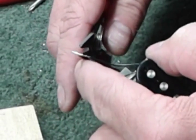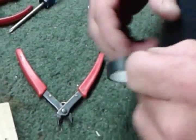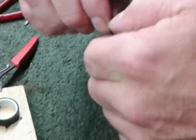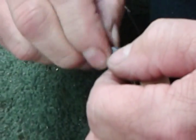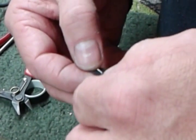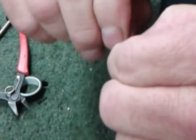Then all we have left is to trim them neatly. I wrap mine typically, but this is also a very acceptable method that's been used for years. Take a piece of your tape that comes with your kit, lay it on there, fold it over, and pinch it. You've got a great insulated joint right there. I'm going to repeat the process for the series link — same thing again. Lay that on there flat, fold it over, and you have a good joint.